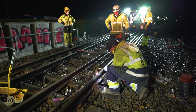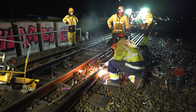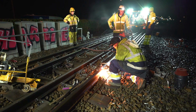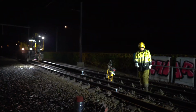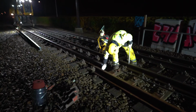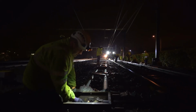On a rail in the closure panel of the turnout, a squat defect has been detected. It is now too late to repair the rail, since the defect is already too big. Therefore, the rail has to be replaced. The night work requires various safety preparations and is therefore very expensive. The moving parts of the switching machines are carefully inspected while the rail replacement is prepared.